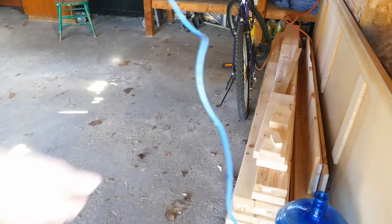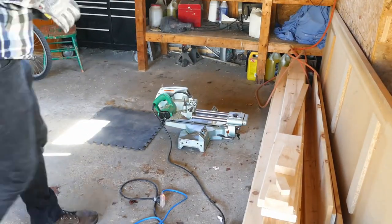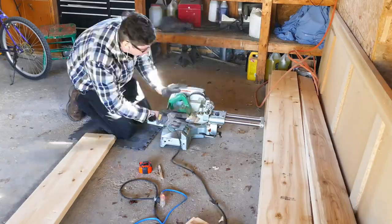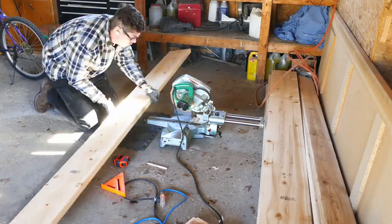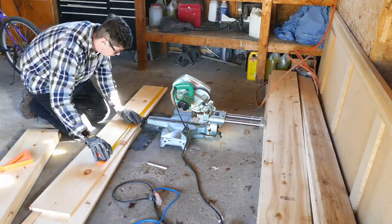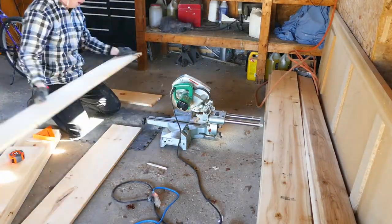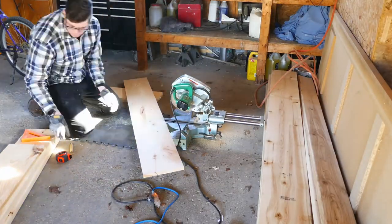Once the Sketchup was done I made a cut list, then headed out to the garage to begin the build. The first cut was right down the middle of the 2x10, giving me two perfect 4-foot boards that would later become the sides. The second cuts were cutting the 1x10s in half. They were about an inch shorter than 6 feet, so I measured all boards to 3 feet on one side. This left me with three 36-inch sections and three 35-inch sections, which is fine because those 35-inch sections will be cut down to 34.5 inches to become the middle shelves.